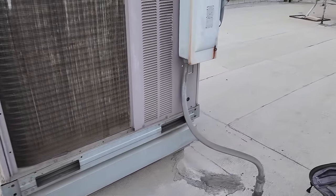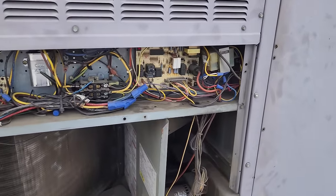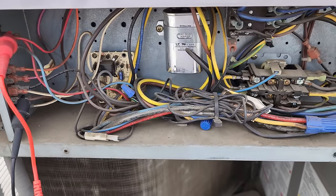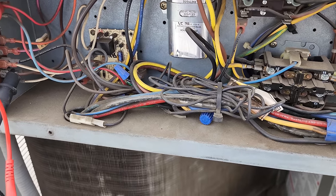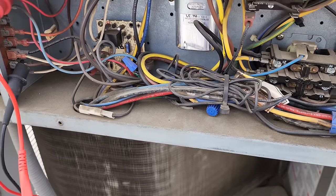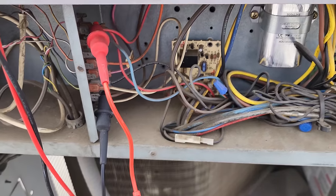Customers are calling saying they've got several ACs down, but I'm starting on this one. This is one of their bar ACs. This older unit has a compressor lockout — it has mechanical logic. If a pressure switch opens, high pressure, low pressure, a freeze stat, or if the compressor doesn't run after a certain period, that compressor lockout board locks the system out mechanically via a holding relay.